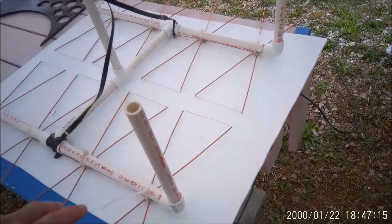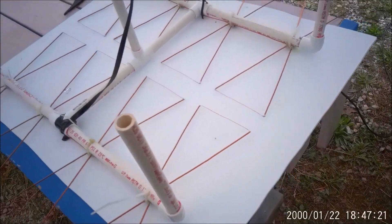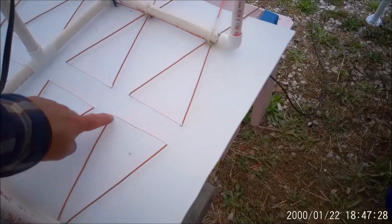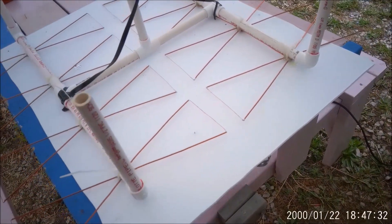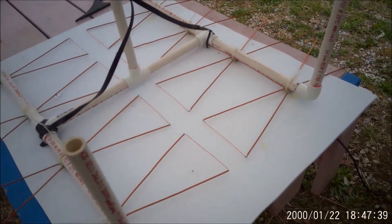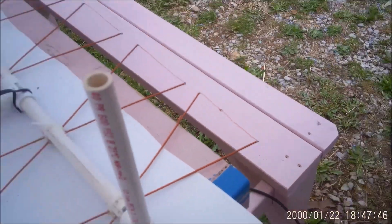I try to do this by leaving these open — that's the way most of them are made. But on a ham website I found out that it might work better if you have a continuous loop. So that's what I did. I ended up soldering wire to every one of them to make sure that it has a closed loop.